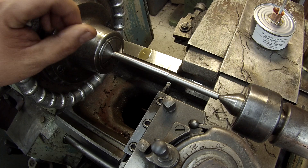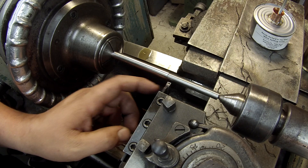We ain't got a whole lot — only 16 thousandths — so we'll take a small cut. That's a pretty good finish on there. We hit 406, so we need 31 thousandths — we'll go ahead and take all that. Alright, we've got this finished and it mics right on 375. We're good here. Now we've got to do an undercut that's nine-sixteenths wide, down to 275 — 7 millimeters — so we've got to take a hundred thousandths off. I'm going to use the parting tool insert to attempt this and I may have to play with speed. I'll try it at 600.